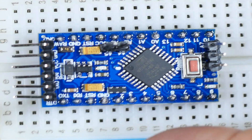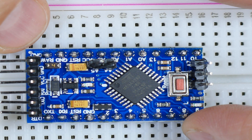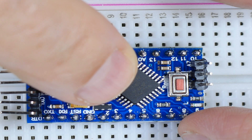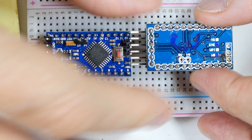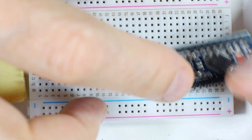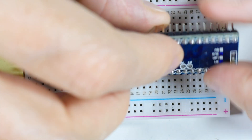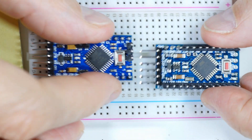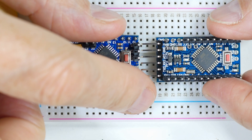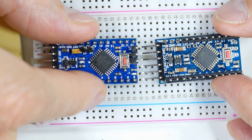Of course, if you're using a board like this — a breadboard like this — it is much easier, and it's better for the chip to have it facing up and away, because you'll get heat dissipation if this thing were flipped over. If I took this one and stabbed it down into the board like this, the heat on the chip would build up inside there, and that would not be a good thing. Plus, I can't reach the reset button, and I can't really see what's going on or see the numbering or anything. So that's one reason why you do pins down and pins up. But if that were all, this wouldn't be worth the video — there are a couple more tricks when you're soldering these pins.